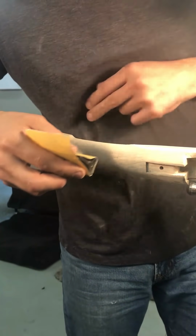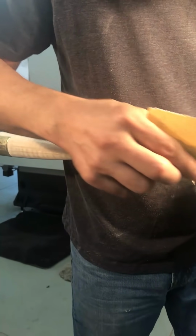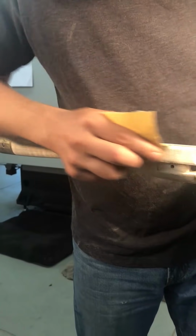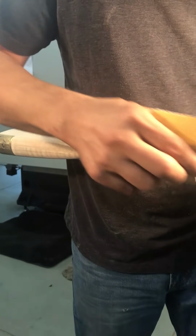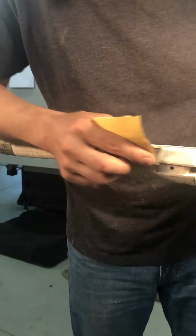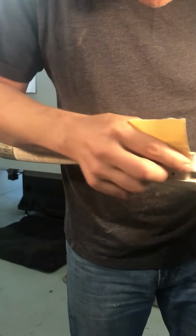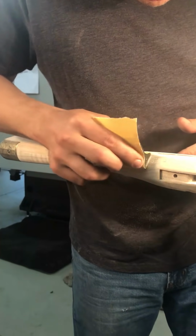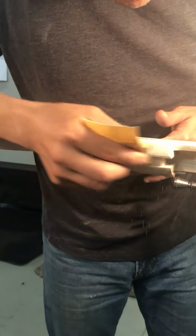Some wood machines much nicer, and by machining I'm referring to the process we use to shape the stocks. And then oftentimes those pieces that machine real well are real hard pieces. Those pieces will often sand a little better too. Softer pieces are more fuzzy and don't machine or sand as well.